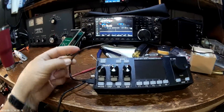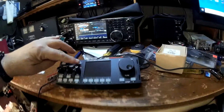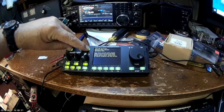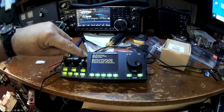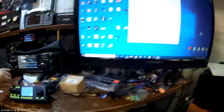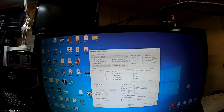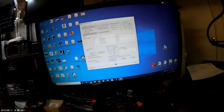Now we have our radio — connect the small USB port. Press and hold the band plus and the power button. The screen says 'Keep power pressed until finished, release band plus to start DFU mode.' When you release that, you hear the USB signal, and at the top you see 'STM device in DFU mode' — that means it sees it.